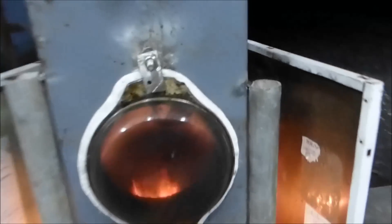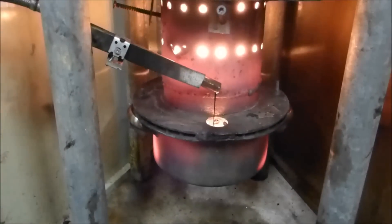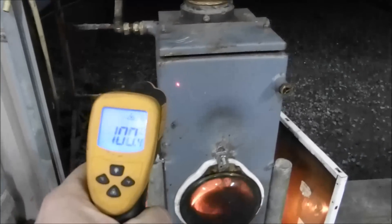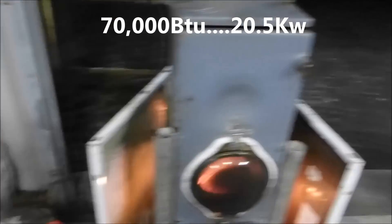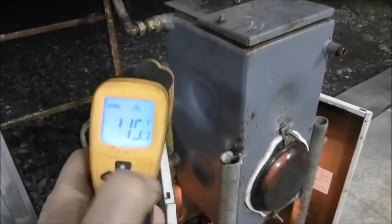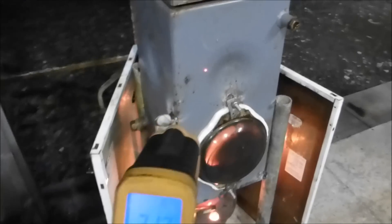I stuck the optics on it so you could see what was going on, if I hadn't blackened the glass. That's the amount of oil I'm burning at the moment, and there's the steam I'm generating. There's no question of it — this definitely would heat your house. That's only a 70,000 BTU boiler; if you've got a big house, 70,000 BTUs or 24 kilowatts isn't going to do it. But a standard house — 1,200 square feet, insulated fairly well — it's hot enough to boil water.